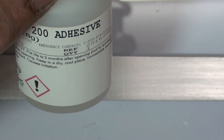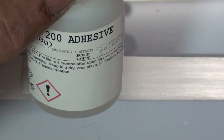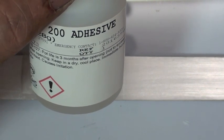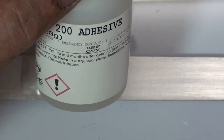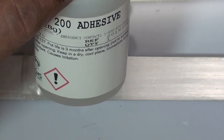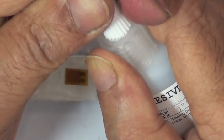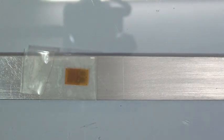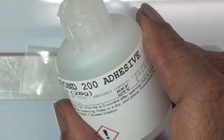Okay. And there's no special requirement for that to be really very strong. So the chances are that if we get a commercial adhesive and try to bond a strain gauge, we will not get sufficient adhesion between the gauge and the component to really measure strain accurately. It's such a critical component. This is the material that's going to transfer the strain, the surface deformations from that aluminum to the sensor that's going to make the precision measurement. So it's very much worth it to have a gauge adhesive that's tested, has specifications for strain measurement, and we can rely on that to transfer strain so that we can arrive at an accurate measurement later.